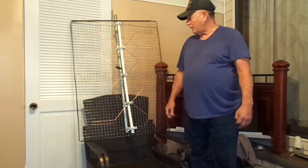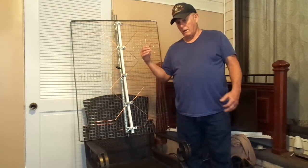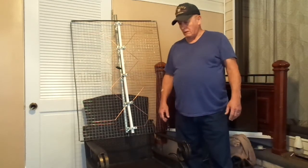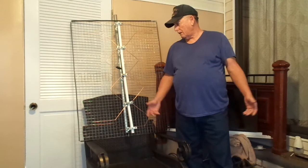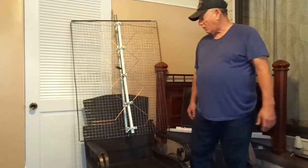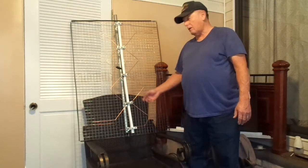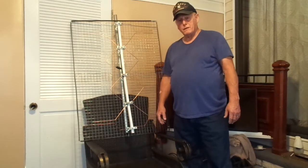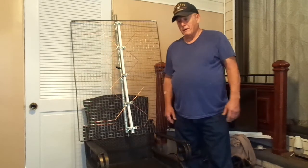If you don't know about over-the-air, it's line of sight. So trees, mountains, even electrical wires in your house, and the weather will affect the antenna. Even in bad weather I usually get at least 50 to 60 channels, so the weather doesn't affect it that much. This antenna is probably good for 60 plus miles — I wouldn't doubt it if it went 100, but I can't say for sure. I know that 74 channels means it's got to go some distance.